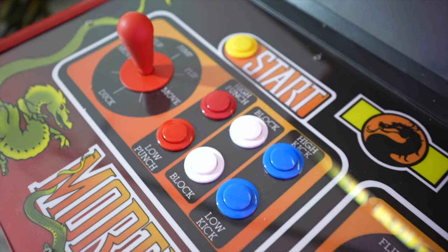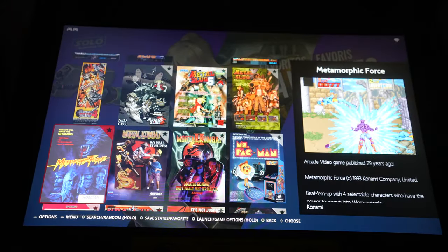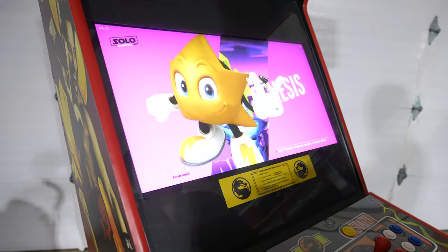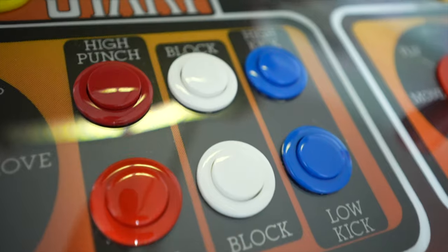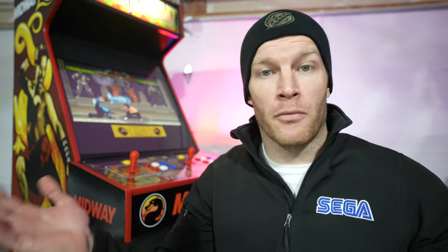Control wise, I went with the same controls I use in every single build — IL Euro joysticks, HAP competition convex buttons with D44X Cherry micro switches. It's got a six-button layout. Mortal Kombat was originally a five-button dice-looking layout, but I configured it for six buttons because it's more versatile for more games. I've got an Android system running in here that'll play anything I want as far as retro video games and arcade games. I had the artwork customized by XL Arcades to make it look unique to the six-button configuration so it looks stock OEM — all the font and text. Mortal Kombat plays with those two middle buttons, two block buttons for Ultimate Mortal Kombat, the top button is block and the bottom button is my run button. Works out great — got all my Mortal Kombat games on here.